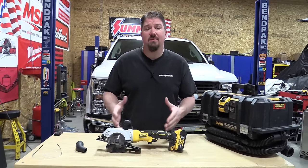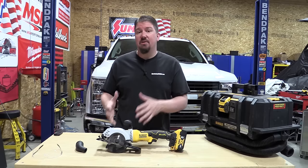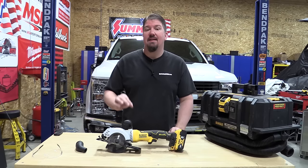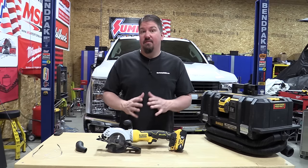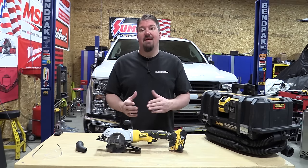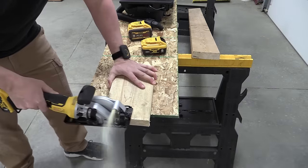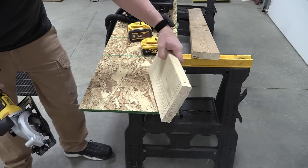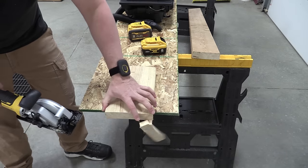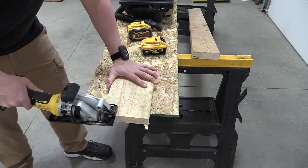This is a really cool saw for a lot of people, from construction down to DIY. Either way, the depth of cut at one-and-a-half inches is really critical if you're in two-by lumber. If you have any warped boards, you really have to follow the board to make sure you get the full cut through everything. There were multiple times where we didn't get that full cut, but not everyone is going to be using warped lumber like we had in testing.